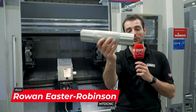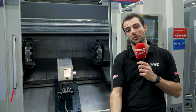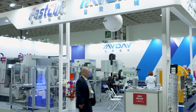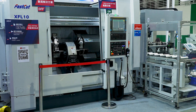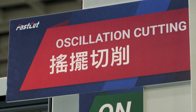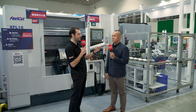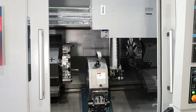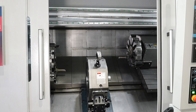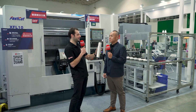Both sides of this part are produced to a really tight tolerance at the same time — that's with central drive from FastCut. So Clyde, it looks like a standard aluminum component, but you're making this in a fascinating way. How are you making it? We are clamping the parts in the middle and then turning both ends at the same time, which gives the parts really good runout.